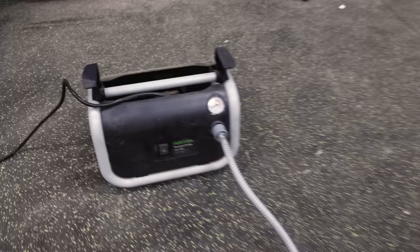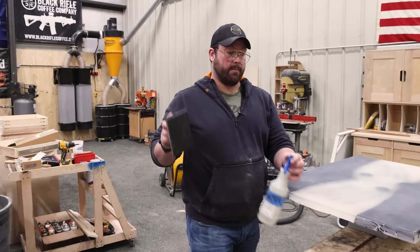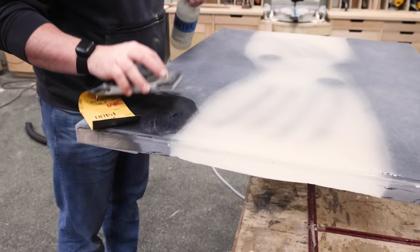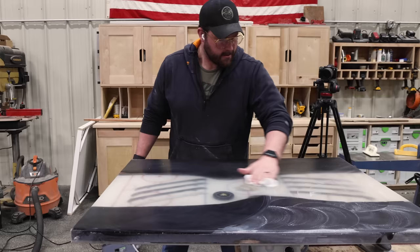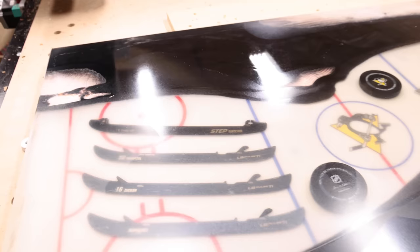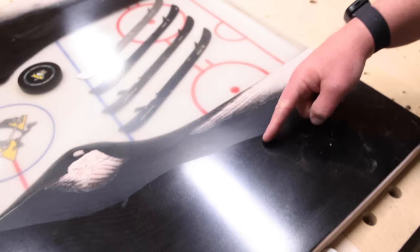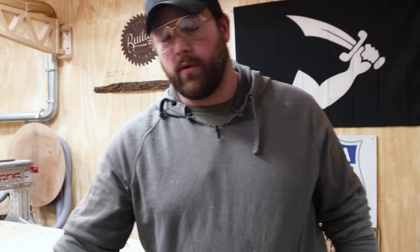We are getting ready for our hopefully final pour. And I think for what is the sixth time on this project, we now pour them. The table's dry and I'm having a couple concerns — some bubbles and stuff — but we're going to square it up on the edges and then dive into sanding and polishing, hoping to resurrect it. There's a little bit more bubbles than I was hoping for, but sometimes you just got to go and sand it. So I want to wet sand this thing and I've got a pretty cool vacuum from Festool. We've got some wet sandpaper, this is 400 grit. After going through a few sanding and polishing grits, I've come to the conclusion that this is way harder than they make it look on Instagram. What's happening in my opinion is that I have too many different kinds of epoxy — we got some top coat, then deep pour, then back to top coat — we're getting different sheens across it. So we're going to resurface it on the CNC, go through the entire process again, and try to get down through this top coat so everything is one uniform coat.